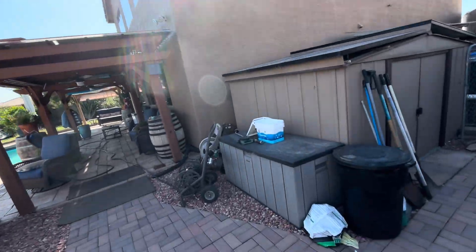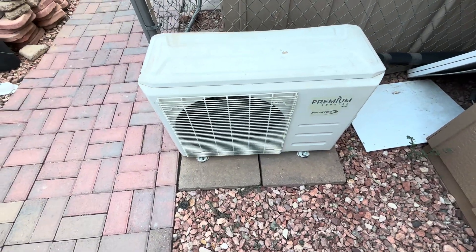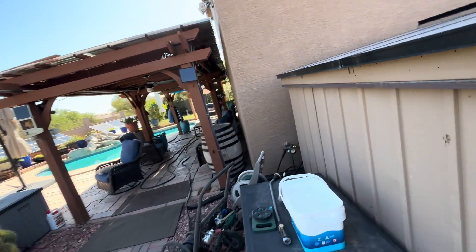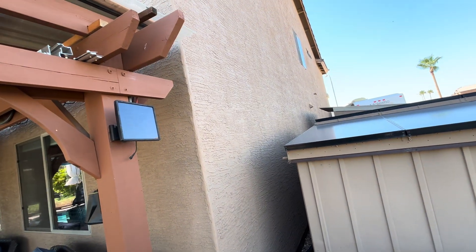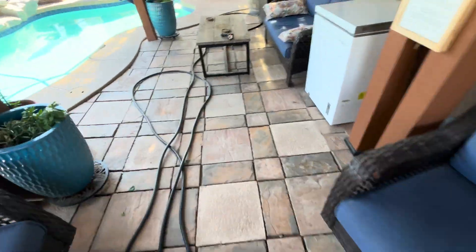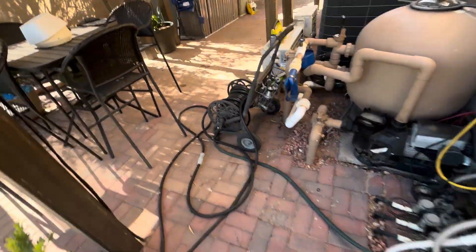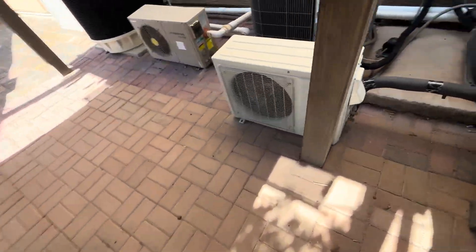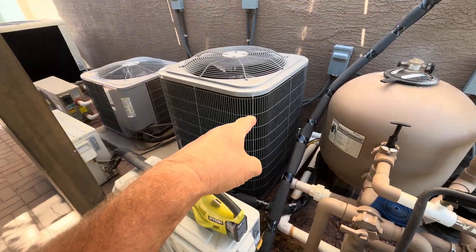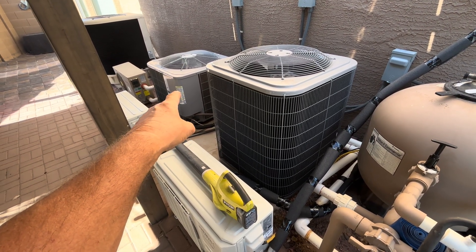Here's the living room mini-split — this is a premium brand. All you hear is the fan on that thing. It runs into the living room on the west wall and does an excellent job. Even though it's the west wall and at three in the afternoon until sunset it'll be about 180 to 190 degrees with a temperature gun. Over here is the other 12,000 BTU Aux brand downstairs — you can barely even hear it. Very, very quiet, not like the three-and-a-half or four-ton heat pumps.